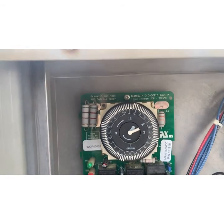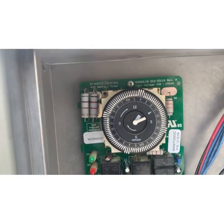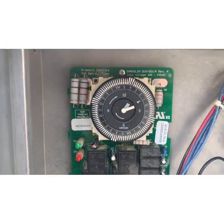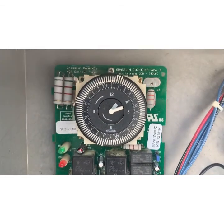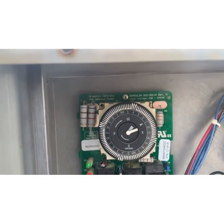So is that a huge deal? You go, well, over 4 hours, it's 20 minutes. So over 4 cycles, it's an hour and 20 minutes. You know, that's not terrible. It's spreading out where you say, oh, I think I'm defrosting every 4 hours. No, you're not. You're defrosting every 4.5 hours. But it's not the cause of our problem for sure.